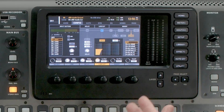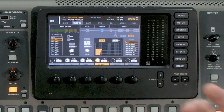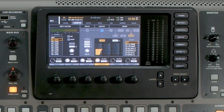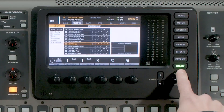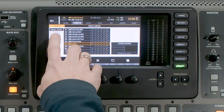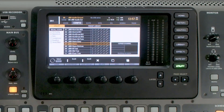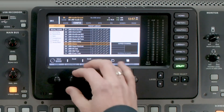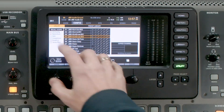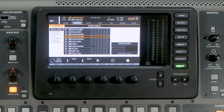The last thing is the utility button, which typically pulls up a hidden menu if one is available on the current view. Pressing utility brings up the preset library, and it automatically has HAConfig and name selected because we are in the configuration section of the board. From here we can load a preset, loading the HAConfig — our head amp configuration — along with the name and icon.